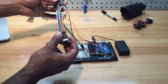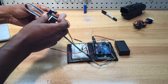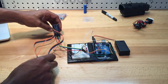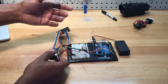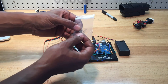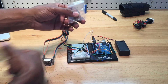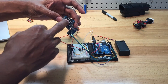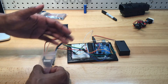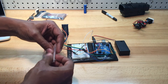The wires can be varied in length — these are just the size they come in. When I do an external version, I will cut the wires down and mount it using one of the Nerf rails, along with a couple of wires for the power source and the IR beams. The system I made before used two IR beams so that once the beam was cut, it would send a signal to the Arduino to tell the countdown to go down. You can use this, you can use a button, you can use whatever you want to tell the Arduino what to do. I'll be around to help edit the code so you can get the performance you're looking for.